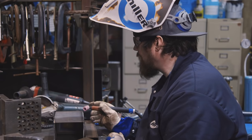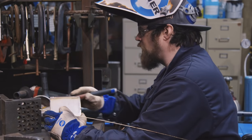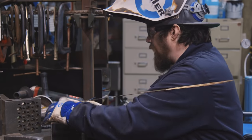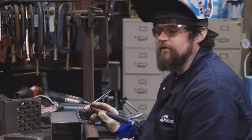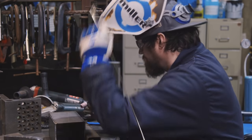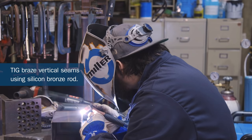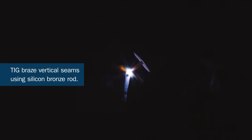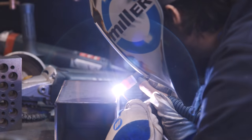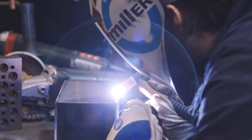I have the bottom area welded up all with stainless. Now I'm going to use silicon bronze and TIG braze all the vertical seams. When I start the weld at the base, I'm going to take the puddle and bring it back a little bit past where this weld ends, so we assure ourselves that there are no cold spots in the seam and it won't leak.